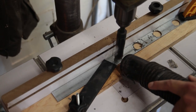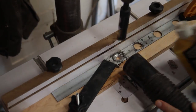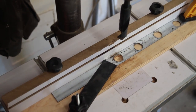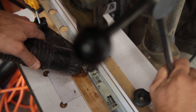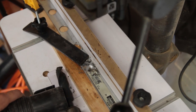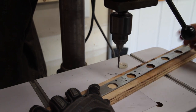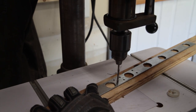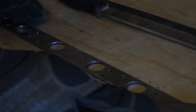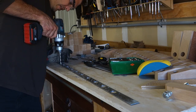I made a lot of mistakes here. I tried to drill the large hole all at once, but I now know you should drill in sequence: start with a small hole, then a little larger, and a little larger again — that works much better. I pretty much ruined the bit and I threw the Jacob chuck on my drill press several times. Use a lot of cutting fluid and drill successively larger holes; you'll have a better experience than I did. A small hole is easy to drill, and the galvanized metal piece is fairly cheap.